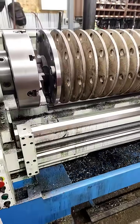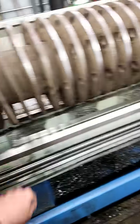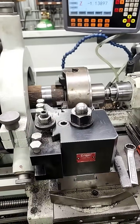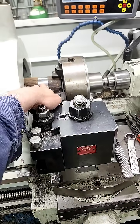Now we got it set back up in the lathe. Currently we are just starting on the first stub end, so we have a four-jaw chuck on this side, dialed it in — this is running dead true. Over on this side we have a four-jaw tailstock chuck, it's dialed in running dead true. As you see here, we have roughed a steady band.